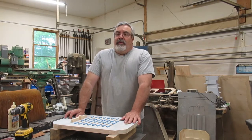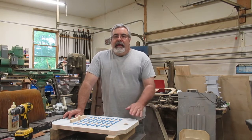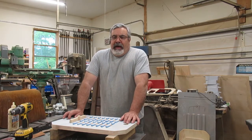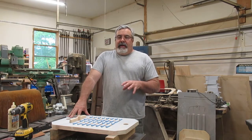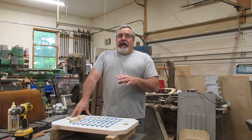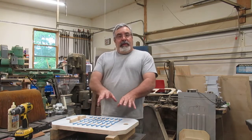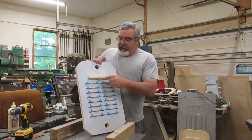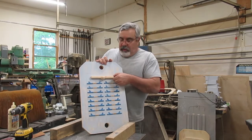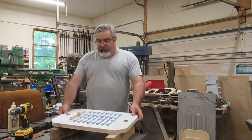I went to a 2-week gating school in Pennsylvania when I was an apprentice. AFS put it on, and we spent a week with non-ferrous and a week with ferrous metals. It was quite enlightening. At the time, we had this guy at Arrow, John Winter. He was like the quasi plant manager, an old Hungarian guy, and the guy was smart as a whip with this stuff. He'd come in and show me what to gate. He'd basically say, I want a 2-inch by 2-inch bowl, 3/4 by 3/4 runner, give me the size in gates. I'd gate that thing and I'd never see it again.